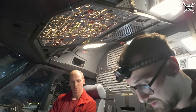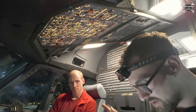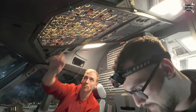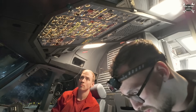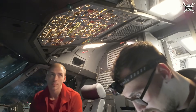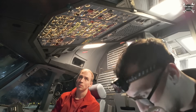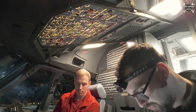Now we will move to the cockpit to perform preparation. Start with the engine bleeds — engine bleed one and two push button, release off, legends are on. APU push button is release on, legend is off. Then make sure that pack one and pack two push button switches are released off, legends are on.